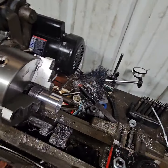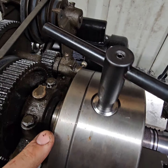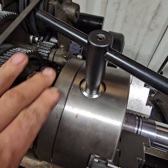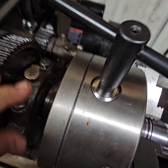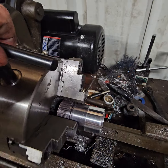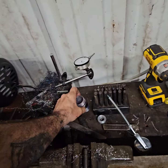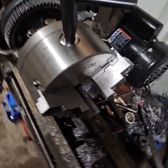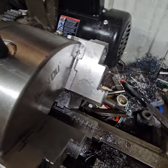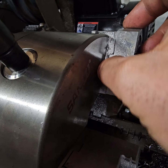So the chuck is a really smooth one. The run out on the faceplate was on 0, so the chuck zeroed well to the shaft, and I'll show you how to unscrew that in a little while. It's a really good 3-jaw. The downfall, I think, of this one is to reverse these jaws, you unbolt it and flip it, and they fit back into the dovetail.